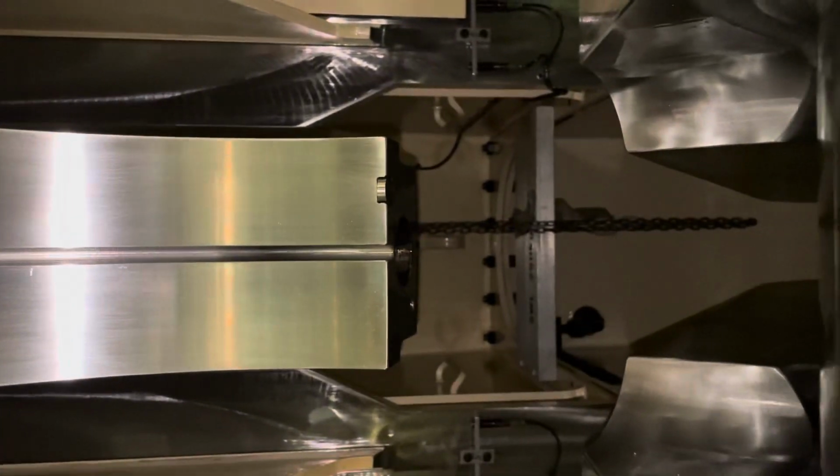Once all are satisfactory, put back the top bearing and lock it by using the bearing locking align bolts on both sides. Then slowly turn the crankshaft and slowly move the connecting rod to sit on the crankshaft and make sure that it doesn't damage the bearings.